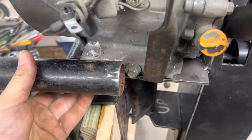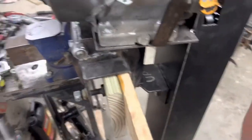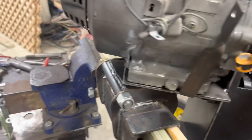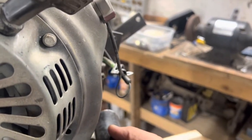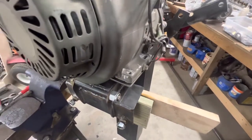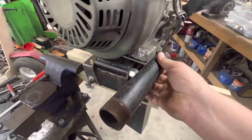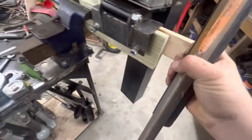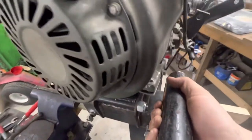Basically what's going to happen is I've got to weld up here, and the issue is it's a piece of steel. Because I didn't make this right when I originally put this together, I should have made this higher — I still have time to lift it up, but I've got to deal with a bunch of extra work doing it. I didn't leave this wide enough for this to sit on, so basically I've got to make a plate that will mount right here. I'm going to take a piece of angle iron, and that'll center it, but the issue is it might hit this bolt, so it's got to come up. I'm thinking weld the piece of angle iron on there — that'll give me a flat edge to raise it up.